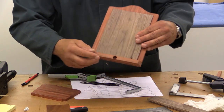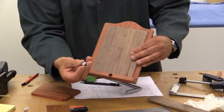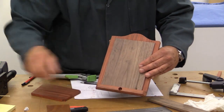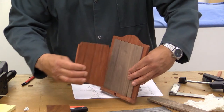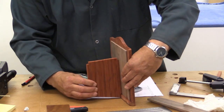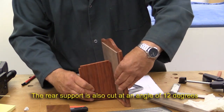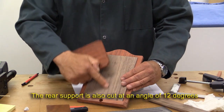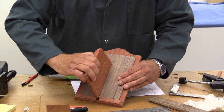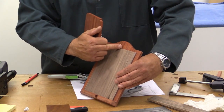I'm going to put a magnet in the hole at the bottom — it's one of these barrel magnets from a DIY shop that push in, and I've already made the hole for that. I'm also making up a rear support using the piece of wood that came out from the center. I've put a screw in it which will marry up with that magnet. This piece of wood will be attached to the walnut backing, and when it meets the magnet it will hold the bottom in place. I just need a small clip at the top to stop that end coming adrift.